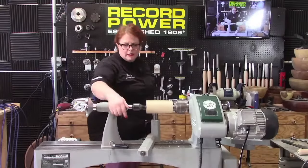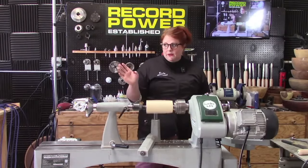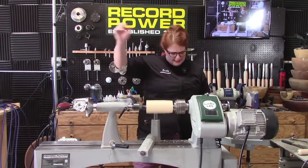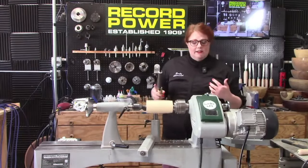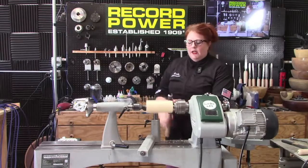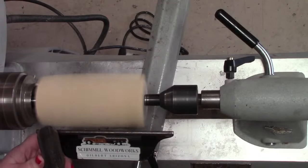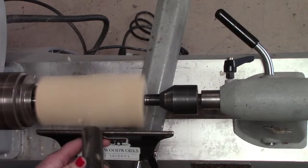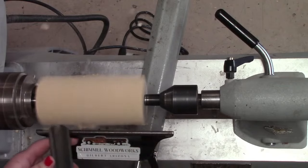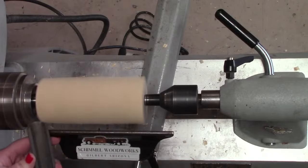Oops. So we're good. Okay, anchor, bevel, cut. We understand those concepts. ABCs, anchor, bevel, cut. Sweet. So we're going to stand out of the line of fire. I'm going to come over here. Again, anchor to the tool rest. We're going to hit that keel of that tool. We're going to raise up until we find our cut, and then we're going to slide across the tool rest. And all we're going to do, back and forth, is just clean that up until we're nice and round.